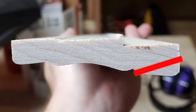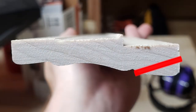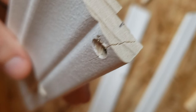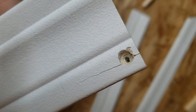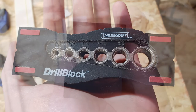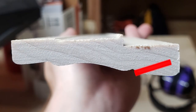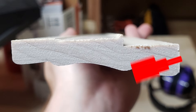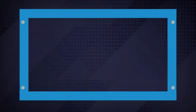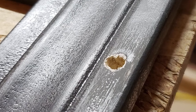There really isn't that much wood holding things together now. Luckily, the frame basically holds itself up and these screws aren't supporting much weight. It's very important to pre-drill holes — this helps guide the screw to the right spot and helps prevent splitting. The same goes for drilling out a recess space for the screw head. On a scrap piece where I was practicing, one hole where I didn't drill out enough recess space split pretty easily. After a few more practice holes, I found that a drill block guide worked wonderfully — it has slots for a 45-degree angle and places itself perfectly. I drilled holes with a small bit, then went back with a 1/8 and 1/4 inch bit to countersink. I opted for two holes on each side, near the corners, then put one last coat of paint on to cover the screw holes.